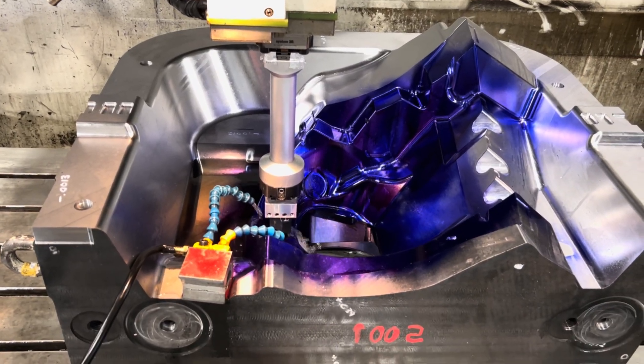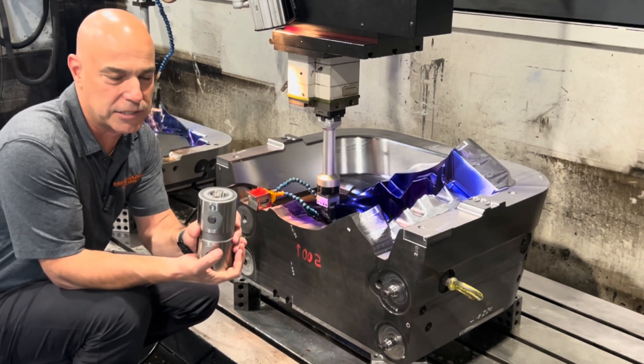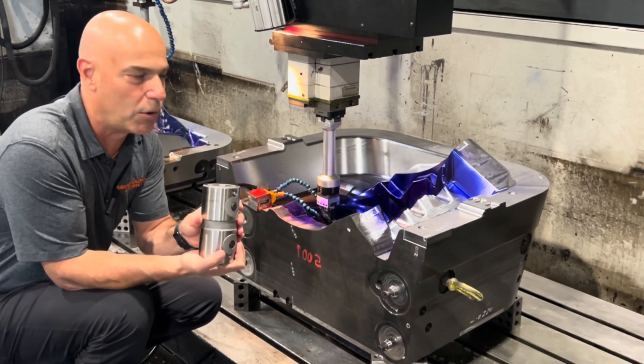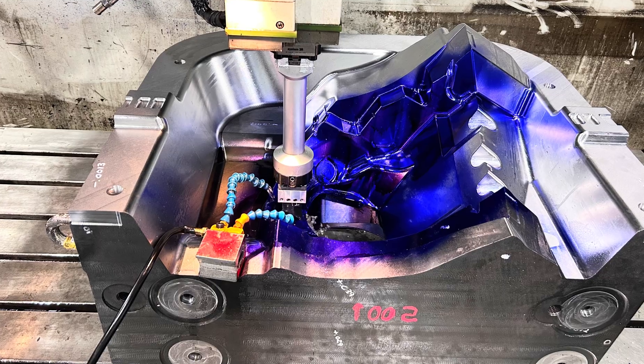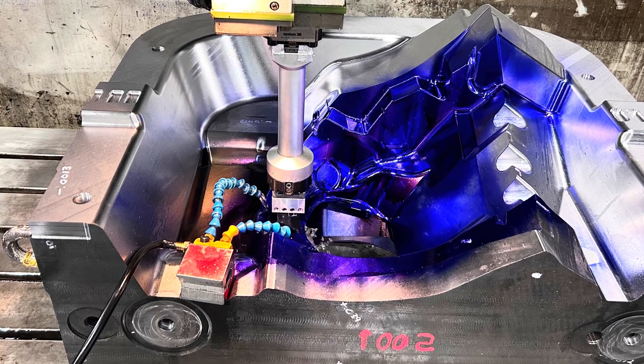In this case we had the spigots mounted to the bottom and the side — that's how we did all the top work, and that's how we did all the boring mill work. It's just a good way for us to process the blocks with the Rapid Holding System hold down unit. A cool project from the die cast world — if you guys need anything done, let us know.